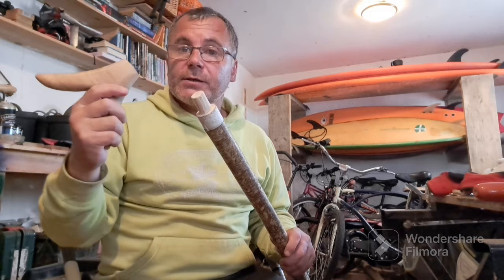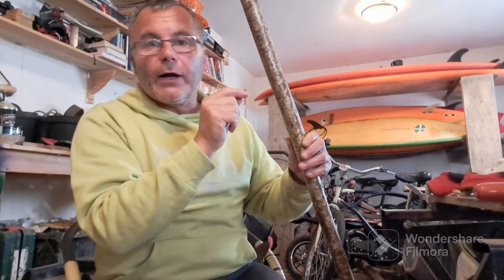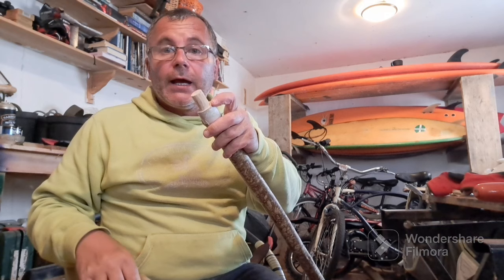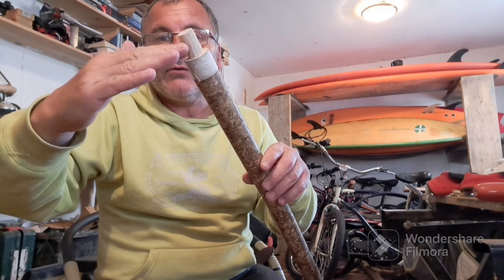moving it down through. And what I'm doing, I'm holding it up to the light. And I'm looking for light along that joint. Now, if I can see light, I actually have to mark where that is, take this off, and on the opposite side, if I saw light on this side, I would take a few slivers off that shelf there to allow it to come down and sit back down on that piece of wood there more flush.